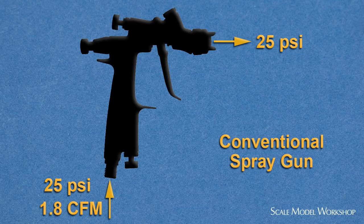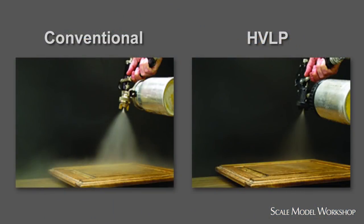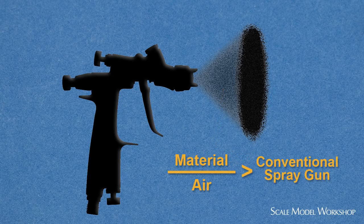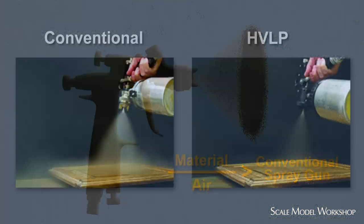They rely on greater pressures going into the device to draw and atomize the material. Greater amounts of air in the mixture result in overspray and fog. HVLP guns use a larger volume, meaning amount, of air at a much lower pressure to draw and atomize a larger volume of material, so you get more material in your pattern with less air, resulting in a significant reduction